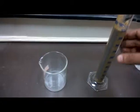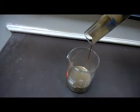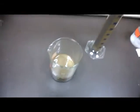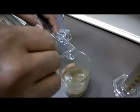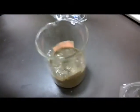What we have here in a graduated cylinder is some hundred ml, which contains approximately 25% solid content of the sludge or cutting slurry expected to come out during a normal process of micro tunneling. Now we will add, on slow stirring, the diluted solution of the Polycat.